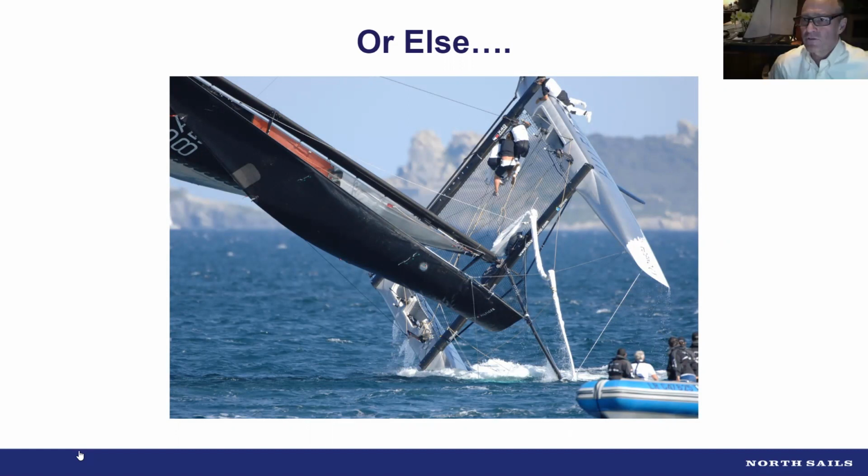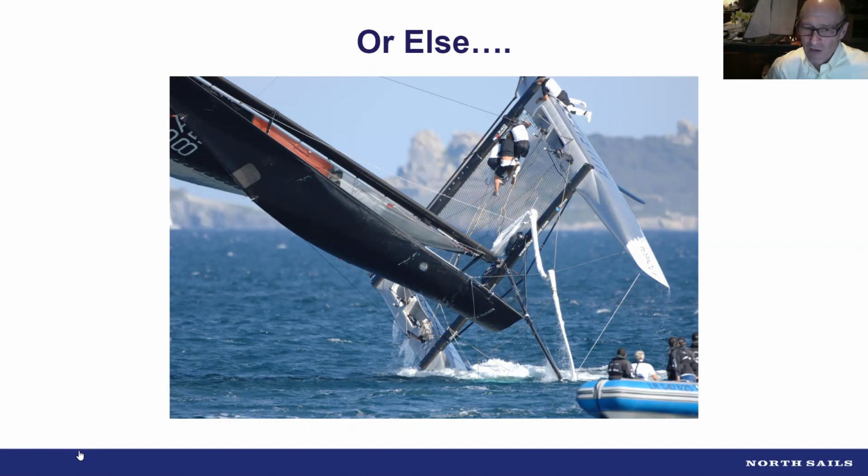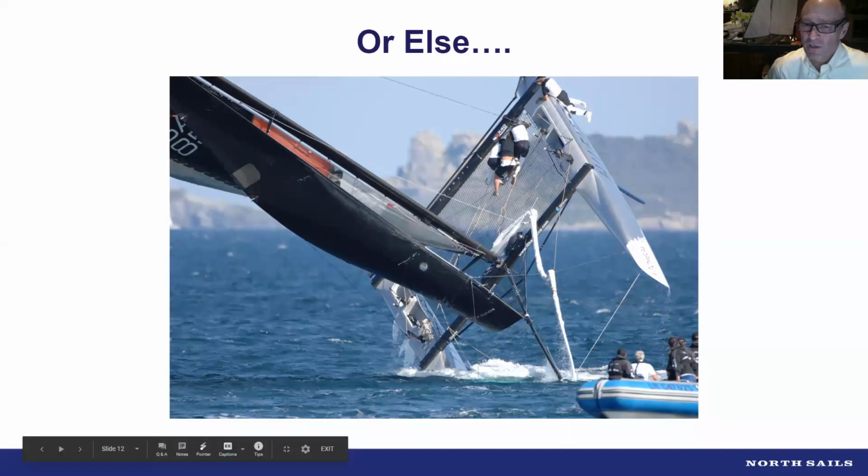Right. And like the TF10 that JB was talking about, I do some sailing on one of those. The boat foils downwind, but it doesn't really foil upwind. The move upwind is to get most of the main hull not displacing water, but not to try to fly it, because you're chasing your tail and you're going to have to bear away too much. Yeah. So Stan, I think you're right. The big point is, how is the boat designed? Because if the boat's designed to fly the main hull upwind, the floats will be designed to support the displacement of the boat.